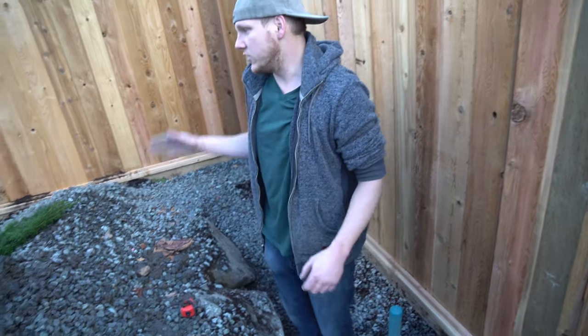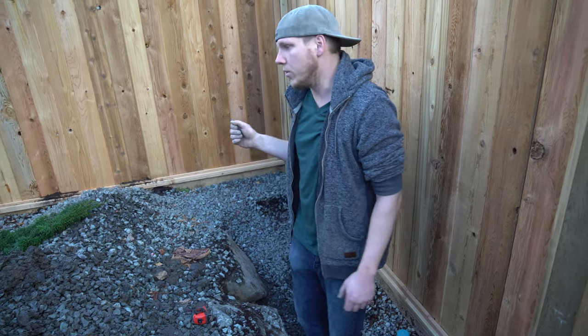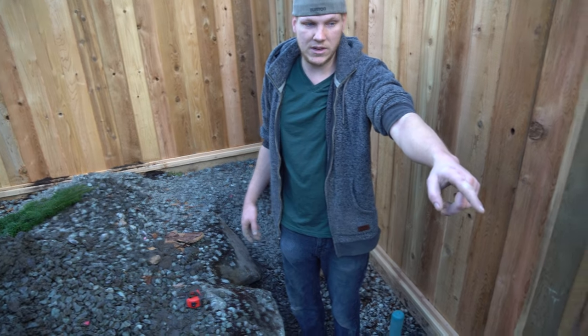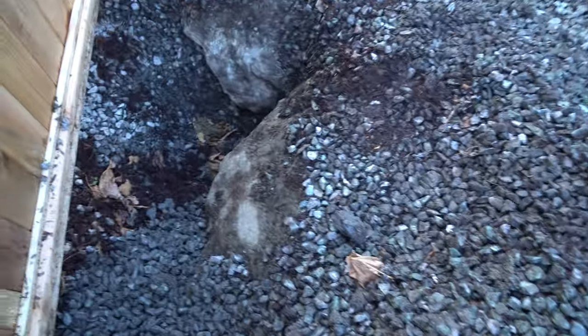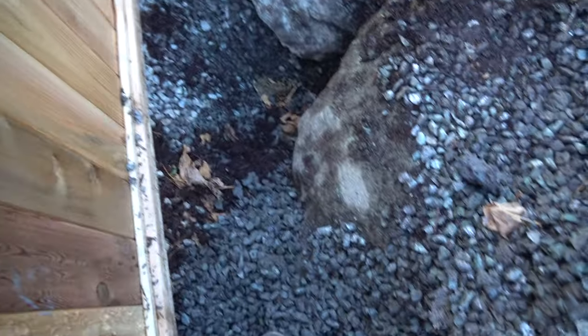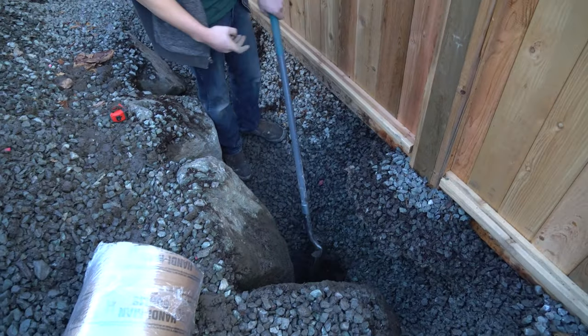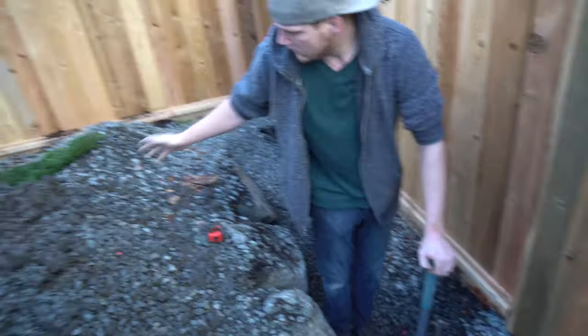How I did my measurements: I trusted how straight I made my fence and measured off the side of the house — a very dangerous game to play. There are three rocks in the way that I still have to dig around. The clay is heavy but great for concreting. This will be backfilled with gravel which will help hold it too — it will be nice and solid when we're done.